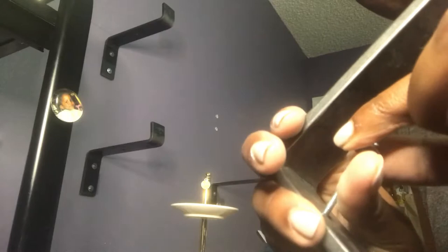The box tells you what size hole you need — this one said 3/8 inch, but I needed to wiggle the impact driver around a bit to actually get it to where the little clamps fit. I had originally bought self-drilling screws thinking that would work, but that was before I figured out I had metal studs. Those came with neoprene washers, so I took them off and put them on the toggle bolts for added support. I do recommend these washers.